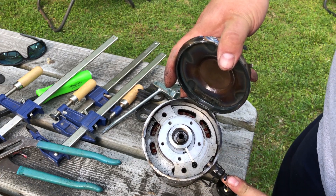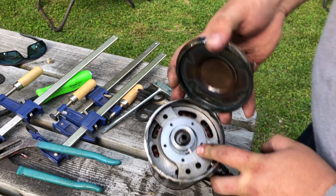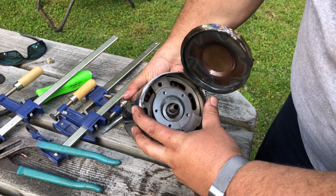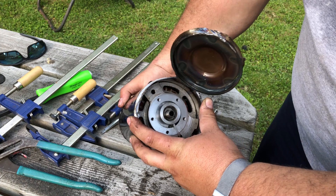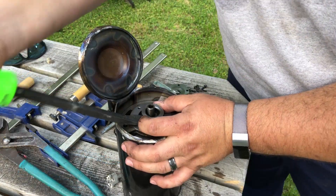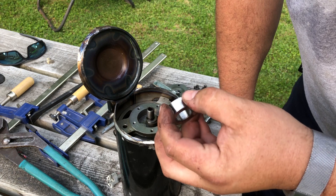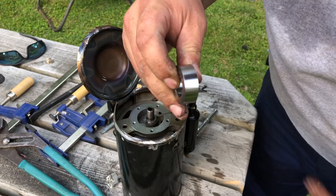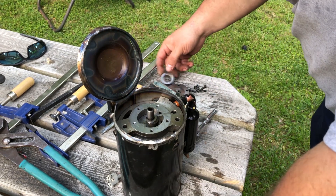So that is a rotary compressor. This is the suction and this is the discharge. I figured this out because this is the suction line right here going right into there. So it spins like this - sucks in, squeezes it out, sucks in, squeezes it out. It sucks it in here, pumps it around, squeezes it out here. You don't even need an oil pump because that's literally just a bushing. There is a little bit of scoring on the edge but not enough - I can't catch it on my fingernail.